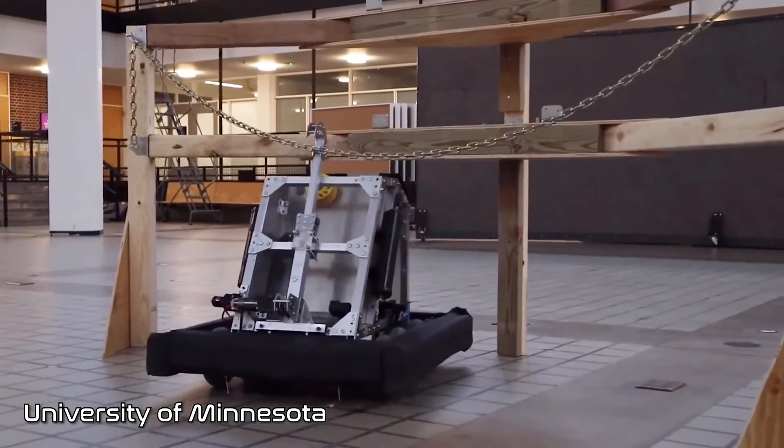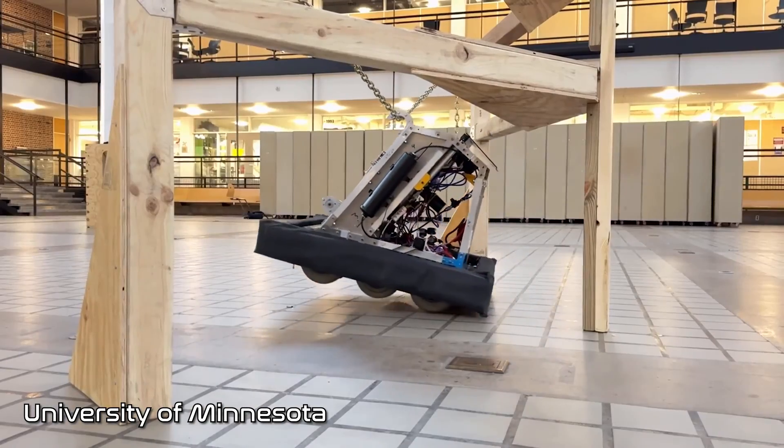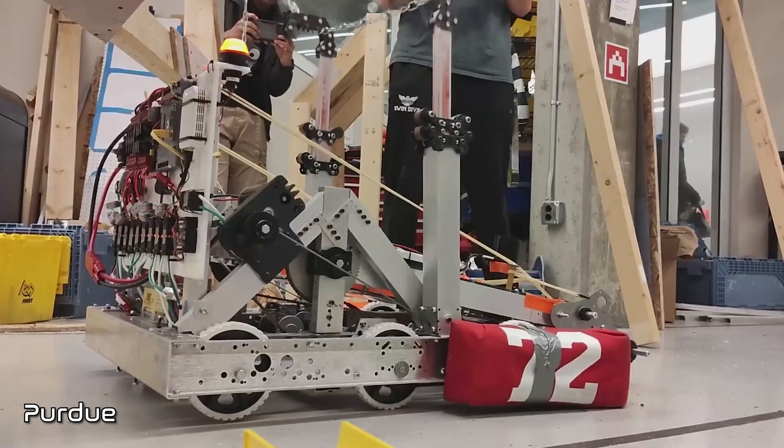Then there are many types of actuating hooks. A Climber in a Box from AndyMark is an excellent example — it is a spring-loaded actuating hook that goes up and then winches itself down. Some robots had two hooks that actuate up and then pull themselves down using two different winches and two different motors. Some just use one.